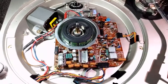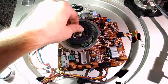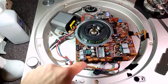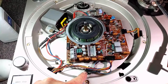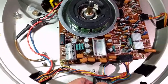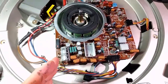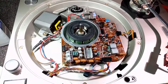This is so much cleaner. I cleaned up some of the rust that was under here — there's a pin that's the key for this spindle, and that key had some rust under it, along with rust and crap all over the place. Look how clean it is now. For the wiring to the trim pot, ground is brown — that's pin 8. Pin 7 is red. Pin 6 is orange. The other three wires are currently unconnected, available for future upgrades.